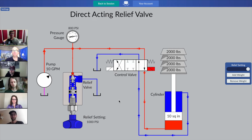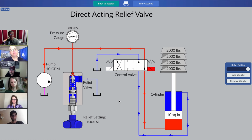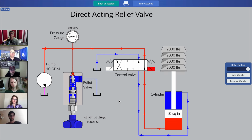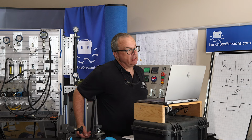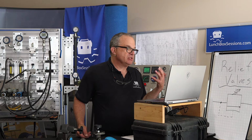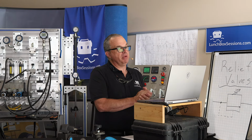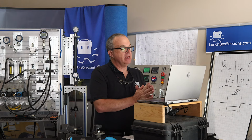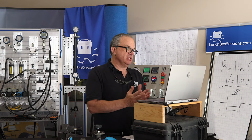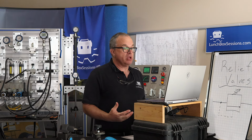Oh, I would like to ask, if I'm approaching equipment and I would like to increase system pressure, should I rotate it clockwise or counterclockwise? Okay, also, yeah, very fair question. It's really good to get acquainted with a pressure valve when it is standalone. If you can get a hold of that pressure valve before it's installed in the system and get to know it and read from the manufacturer spec sheet, that would be the best and safest way to make sure that what you're doing is correct when you make adjustments to it before you get busy.